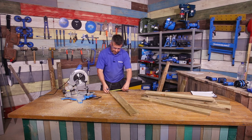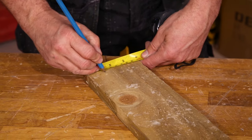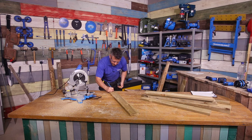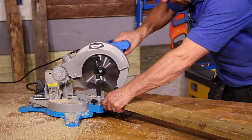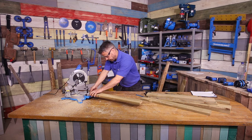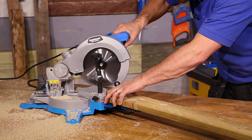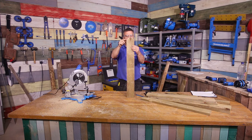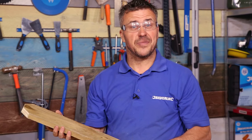These widths are exactly 100 millimeters, so I'm going to measure in 30 millimeters on one end, 30 on the other end, and 30 on the other end — a little mark here and here — and the same again on the opposite side. That has given me that great hexagonal shape that I want. Just got another 150 more to do.